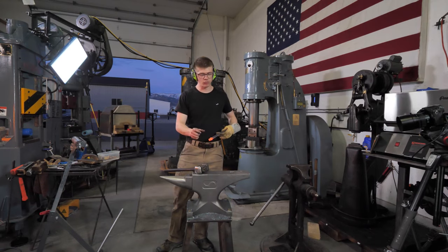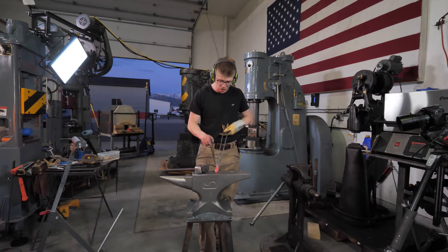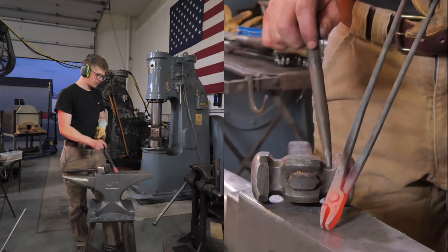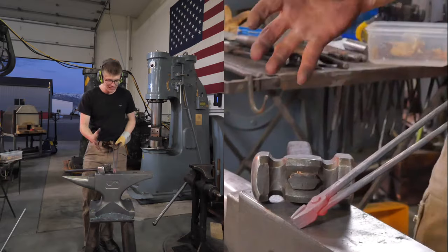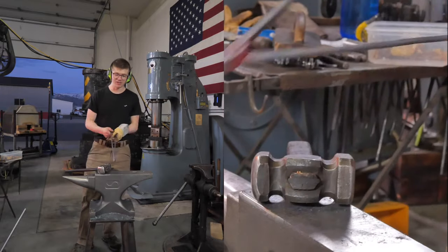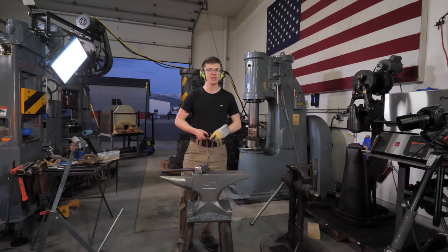So, you saw that? I took a heat right at the end. If your tongs are built with a geometry that includes a proper reverse taper, meaning that in this cross section the thickest area is right here by the boss, and similarly in this direction the thickest area is the pivoting area, you're going to be able to heat them up, have them hot, and open them up, and the point of least resistance is going to be the rivet, so you won't bend your reins. You can open them up without bending your reins, just loosening the rivet. That's a good tell that your geometry is constructed correctly, because they'll open up nice and easy. It's important that that's the thickest up right there so you don't have binding issues.